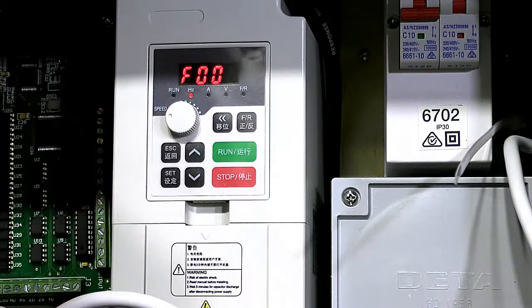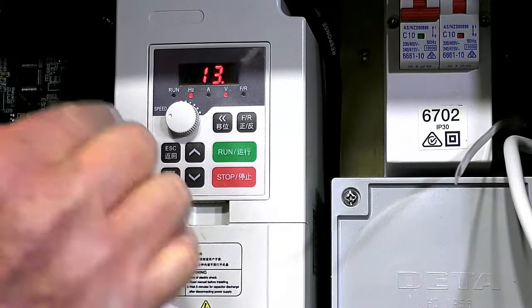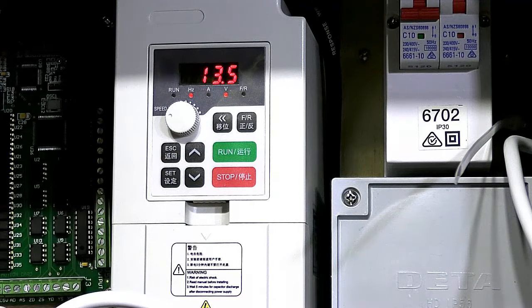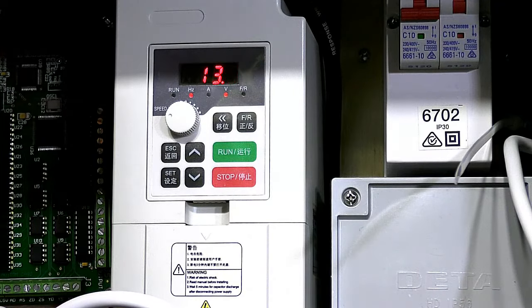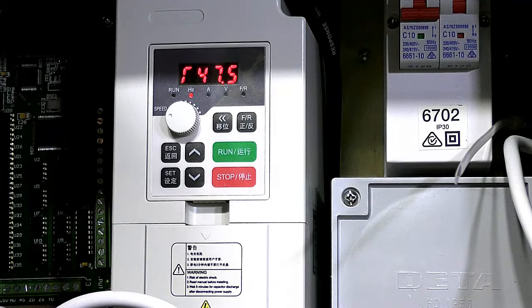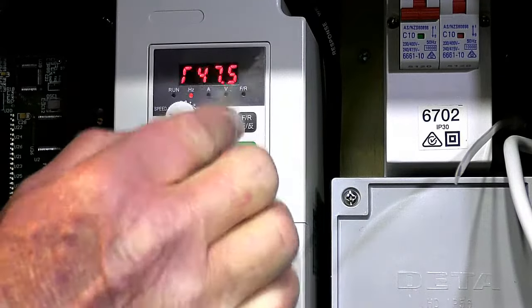Going back into registry 9 and checking the booklet. The intermediate voltage value of 13.5 is actually probably fair. I could take it up to about 15 but I'm going to leave it as a factory setting and we may alter it later on down the track when we get it running.